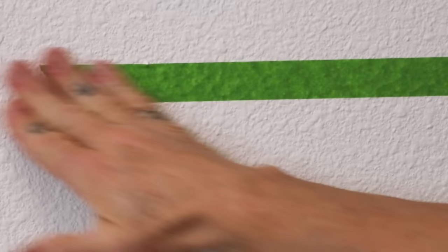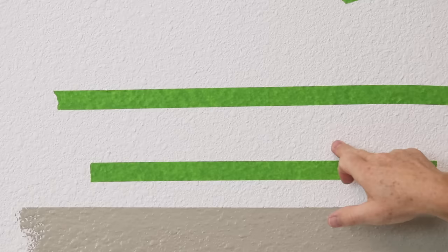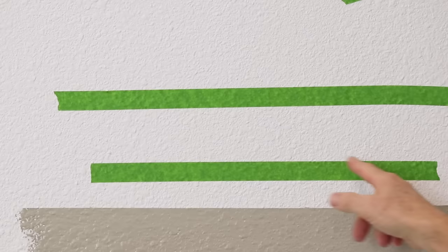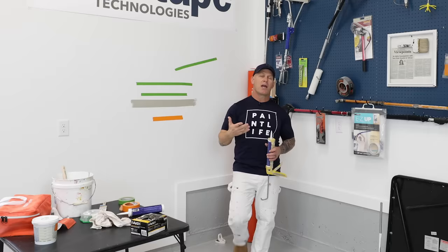We're going to mask and make a stripe on this wall to simulate how the method works. If I apply caulking and then allow it to dry before peeling the tape, the caulking bonds to both the wall and the tape — what we call bridging — and when you peel it off, it pulls away from the wall in spots, leaving voids you have to touch up. So with this caulking-your-tape method, you have to pull your tape before your caulking dries and before the paint dries.